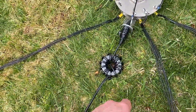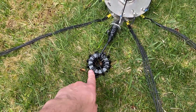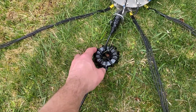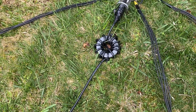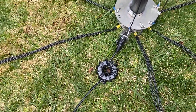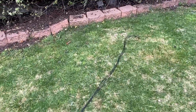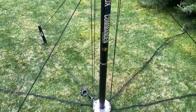What I did — you would have seen the video I did about the toroid for common mode current — I've left it out of the box, and I've done that for a reason. I had a couple of comments on the video saying why did I put it in a box. I want to test how good this ferrite material is in the UV light we have here. The UV is very strong here in VK7 and I want to see if it gets brittle. I'm pretty sure it'll be fine in the rain but I just want to see what happens in the UV. Then the RG-58 just goes off to the shack. I've got five radials bunched in there which then go to the base plate and they're just strewn out on top of the lawn.